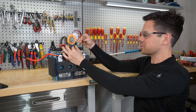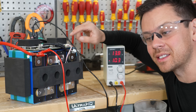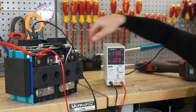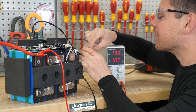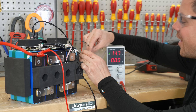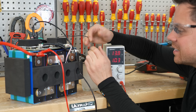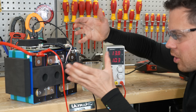Besides the crooked bus bars everything's looking pretty good. Next we're going to test the temperature sensor. With over temperature, that's going to be the temperature sensor on the BMS, not the cells — the cells take a lot more to get hot. So we're charging with 10 amps and we'll stick it in cold water. Oh my gosh, it works! That's insane. Let's heat it up — this is as good as a Watt Cycle or a Leatime; it's on par with all of those.